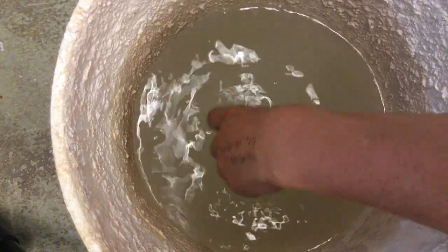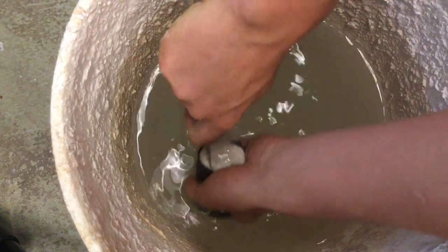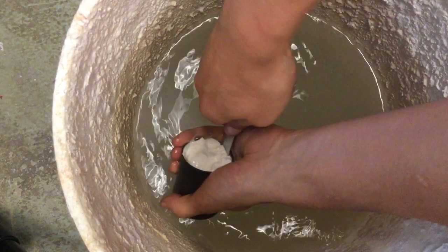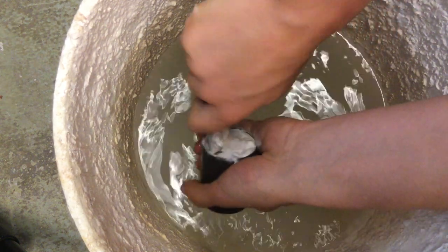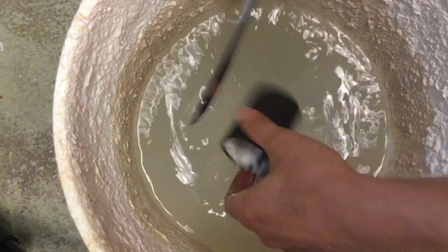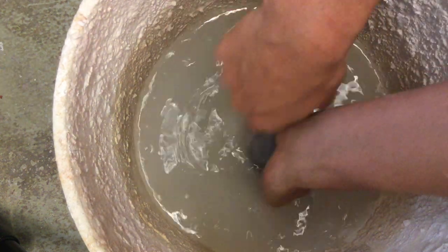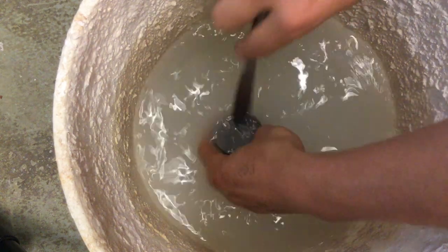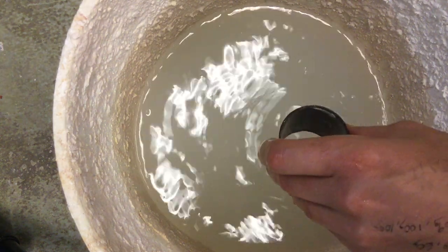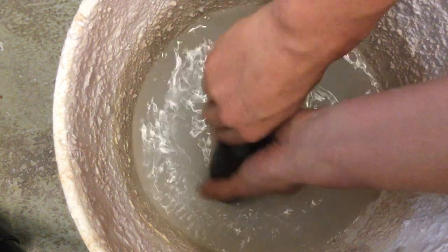The small stuff is very easy to cool down and you'll get a hold of it fairly quickly. You want to clean your flask out first because that is the hardest thing to do when it comes to cleaning up your part. If you forget to clean your flask you end up chipping out a bunch of plaster and it's a pain, so it's better to take the time.